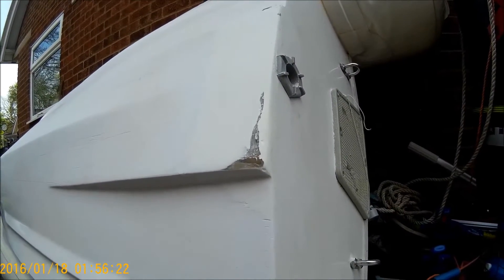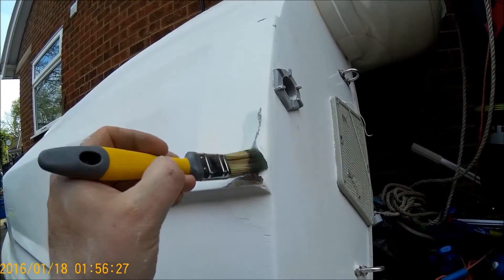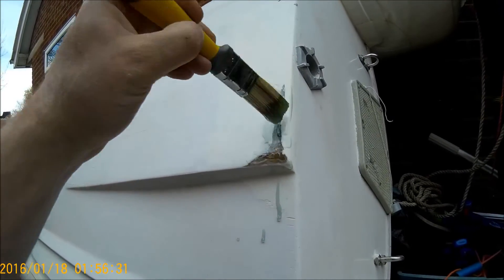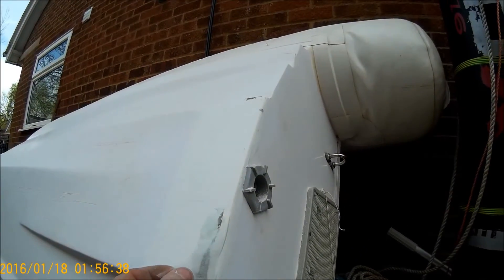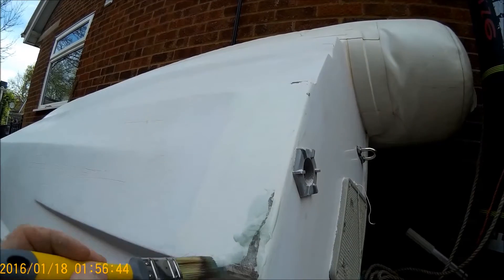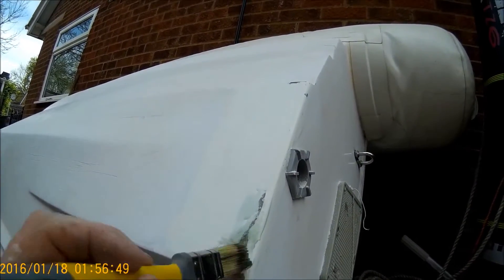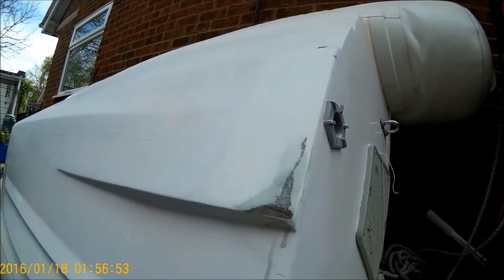So I've mixed up my resin. The first thing I do is paint a bit of resin onto the damaged area like this. I'm trying not to make a mess — I'll clear that up afterwards. We paint this on and then we apply a piece of fiberglass, just like so, and then dab that in. I may have put a little bit too much resin on here. Completely saturate the glass so it's completely saturated with resin.